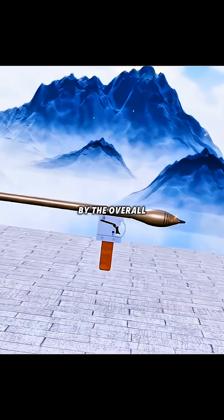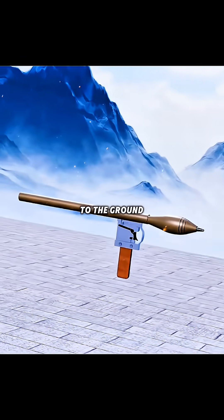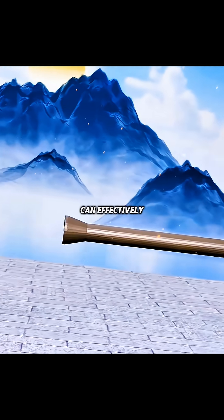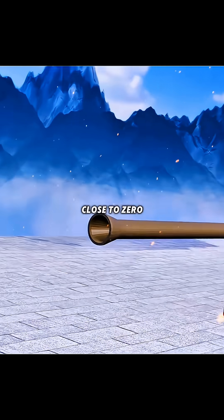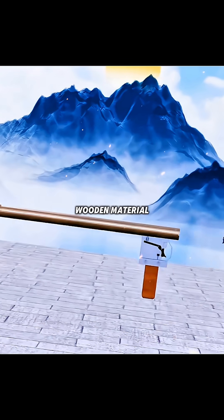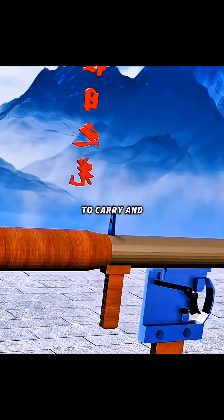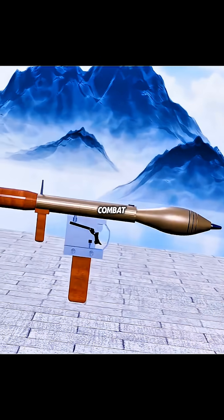This perfectly solves the problem of firing, but the recoil generated by the overall suspended launch of the barrel cannot be effectively transmitted to the ground. So you add a bell mouth at the tail of the barrel, which effectively disperses the recoil, making it approach zero. But what should you do if the barrel overheats due to continuous firing? You replace the barrel grip with wooden material, add a handle, and finally add a hood and sight, which is not only convenient to carry and hold, but also enables continuous shooting during combat.